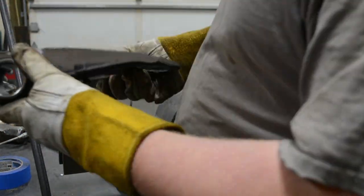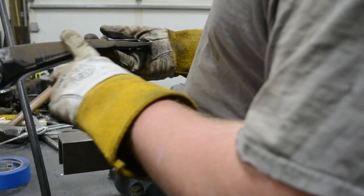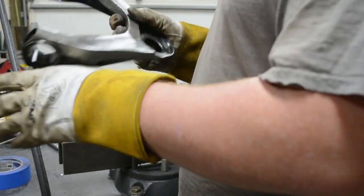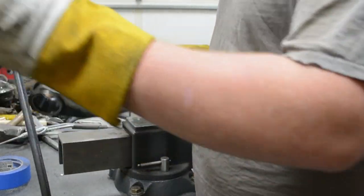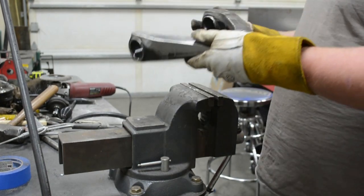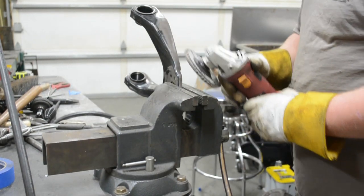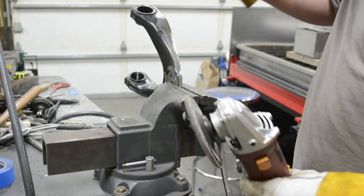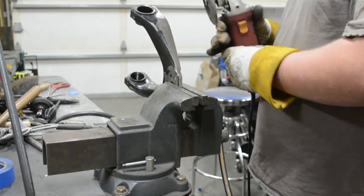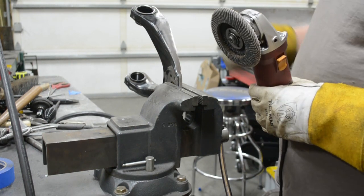So we got everywhere knocked down. A good sign it's going to come out nicely is if you have a pretty nice sharp corner without a bunch of indents — it'll come out nice. If it's too big of an indent, you'll probably have to come back and fill it, but this is looking pretty good. We might be able to do just one pass of a grind and be perfect. One last tip: do the full length. Or if you stop, try to blend it out. The longer you can do it, the more consistent it'll look. If you can do the weld grind and round in one go, it'll come out almost flawless. If you have to come back and tack, tack, tack again and re-grind, a lot of times it starts to get a little wobbly. If you can get a good first pass, it's going to look the best.